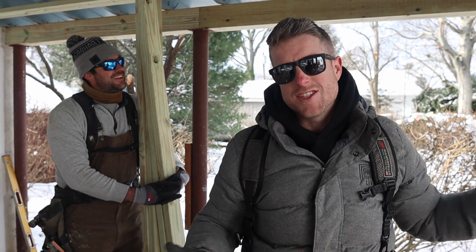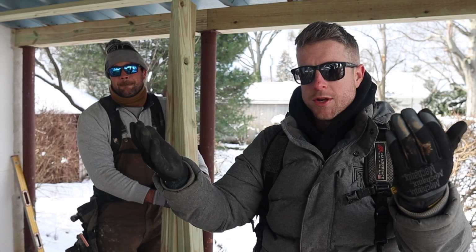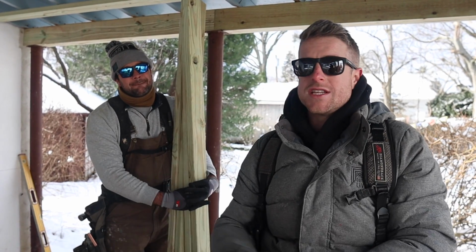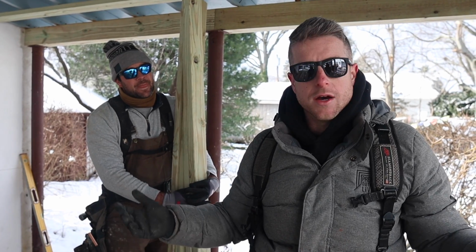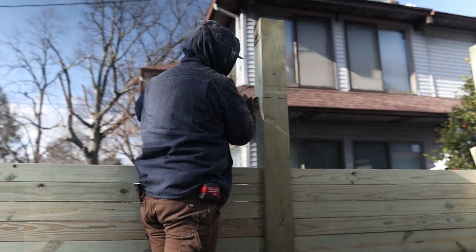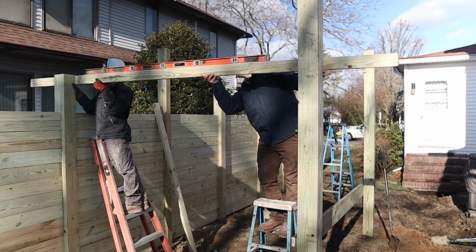But anyway, you saw how straightforward the process is. You build those temporary walls, you can remove that beam, put a new beam in there. You know, you're gonna have to make some adjustments. You're gonna have to be really delicate, cutting all the nails out so you don't mess up the rafters. And then take that wall out, you got your new beam in there, good to go, good as new, better than new, for the next 100 years. Onwards and upwards. You got it kind of straight on.